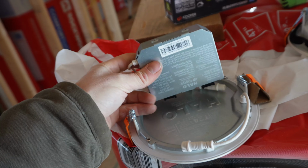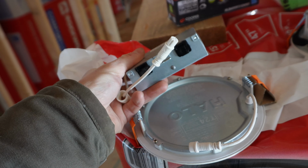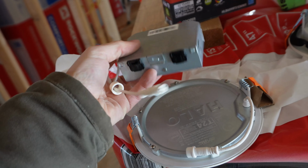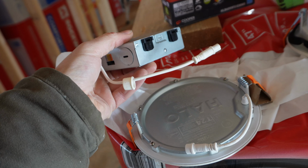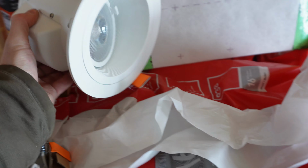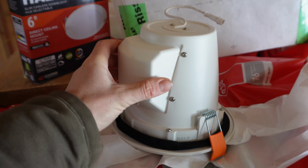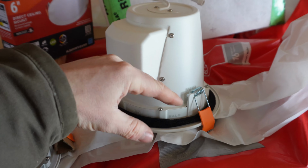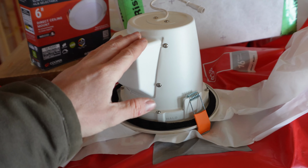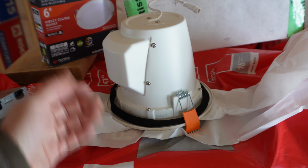So if we ran the Siga flat to the ceiling and drywall right on top of that, there would be really no place for this guy to live for the wire to come in, and this needs to stay up in the ceiling, obviously right up next to the insulation. We'll also have some of these slopable recessed down lights, also from Halo, and these have more of a housing on them to accommodate that sloping mechanism. Again, this comes with the gasket, but we still wanted to keep an airtight barrier around this can as well.